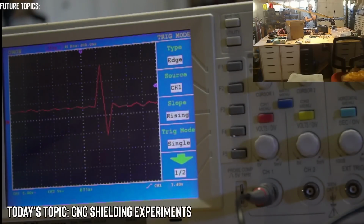I think this type of experimentation, we probably wouldn't be able to do enough of this, that it's so significant. Yeah, I don't think the controller would know what to throw. It would maybe keep its same state, but I would think it might throw a 1, depending on what else is going on around it. That is considered no man's land, so I don't know what would happen. If it was an active low or active high, depending on what state it's connected, it could throw a 0 if it's active high. It could throw a 1 if it's active low. I don't know what would actually happen, but that's the problem, because not knowing is a recipe for disaster.